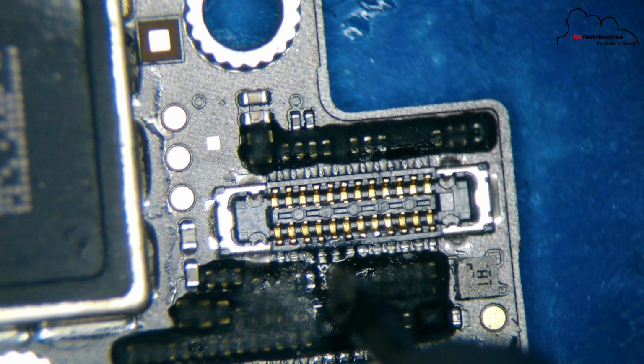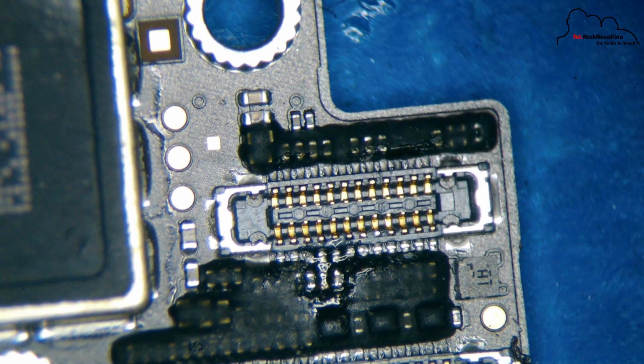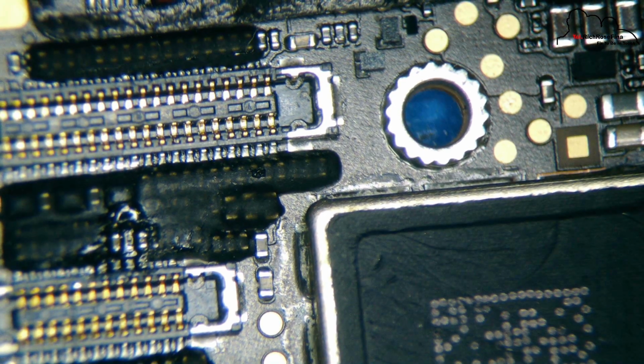It is caused by the home button and the touch ID sensor, in case it be a resource problem, or the broken touch function from the display. So I say we be careful and check the pins of J5800. We check it to see if it solves the problem. Resolder, and check again.